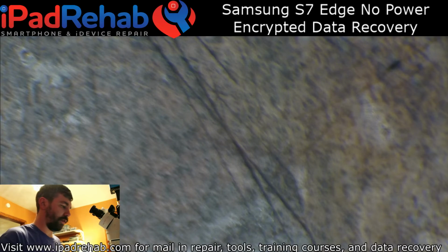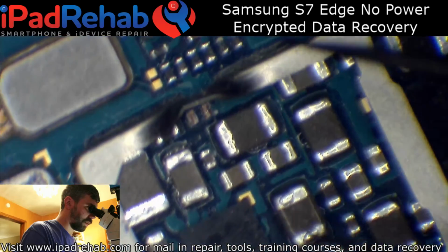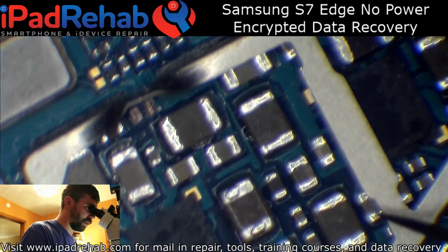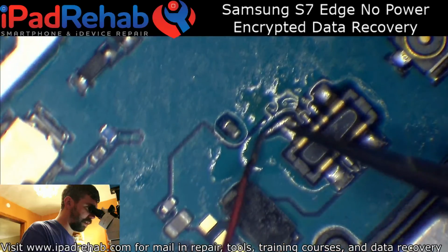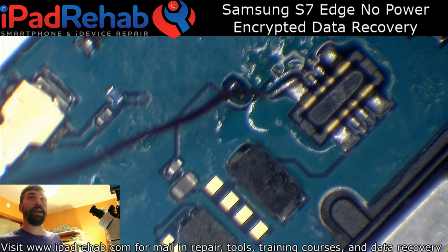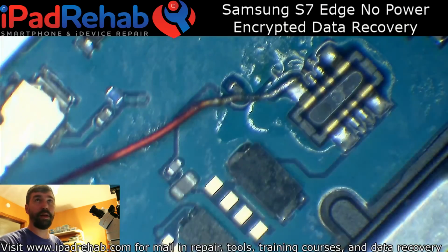So just to go over what's been done so far: hooked up DC power, prompted to boot, found that it was consuming 750 milliamps and getting hot right around in here. We found a shorted line, found an ugly cap, popped it off. Now it's attempting to boot and giving an image, but I want to charge this up and see if it's still boot looping off the battery. If it is, I'll come back and pick the stream back up. It's probably just not liking booting off DC power.